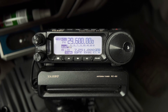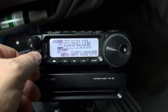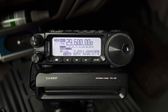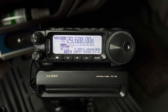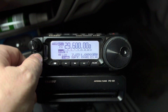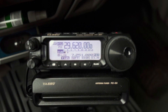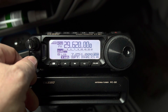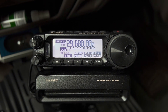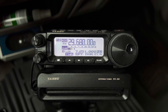I've already this morning heard a couple of 10-meter repeaters, one on 29.620 and another one on 29.640. Now 29.600 is the simplex frequency and you can use it as a call frequency. You'll notice 29.620, 29.640, 29.660, and 29.680 are very common repeater frequencies.